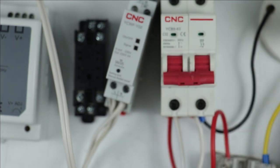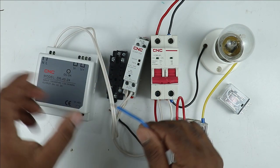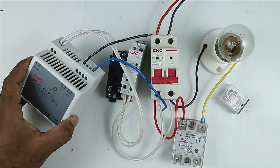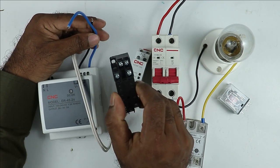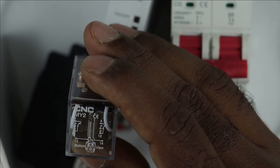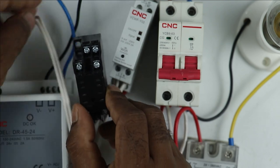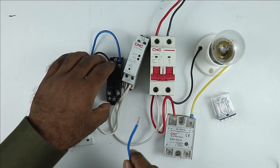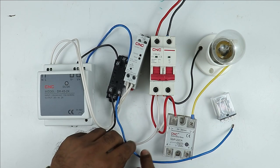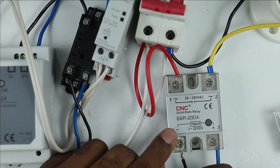To do this, I have to connect wires with the positive and negative power supply terminals of the SMPS. I am taking two wires — one connected with the positive terminal of the SMPS and another with the negative terminal. Power supply from both these wires will go to the common terminals of this relay — terminals 9 and 12 are common terminals, and 5 and 8 are for NO contact, so we have to use those contacts only. The above terminals, which are terminals 5 and 8, are the NO contact terminals. I am connecting these wires with both those terminals. From the common terminal of this relay we will provide power supply to this SSR so that it turns on.